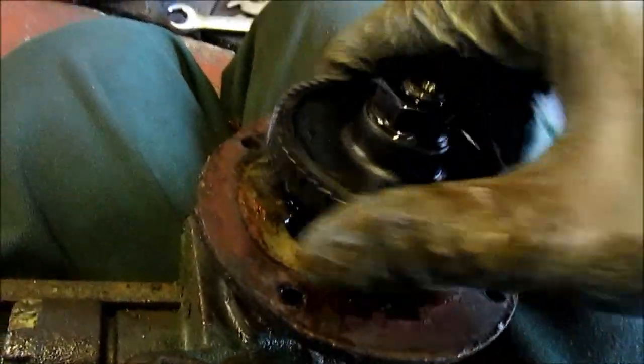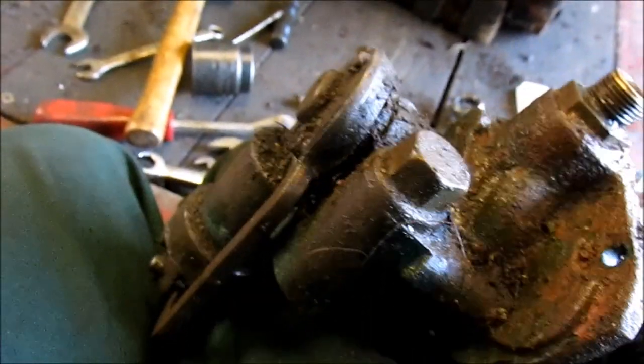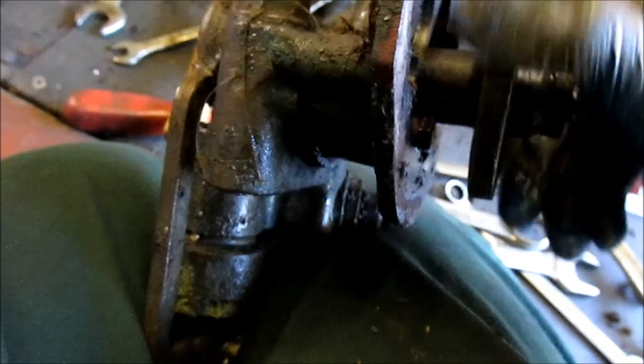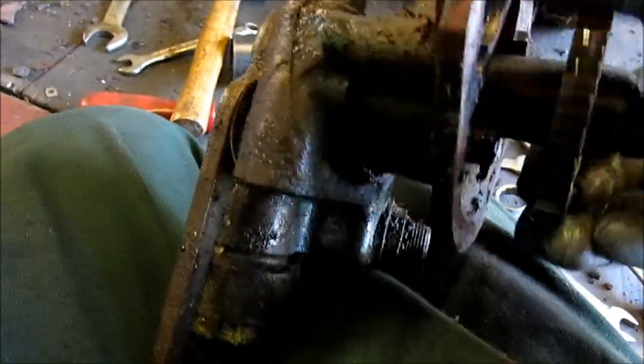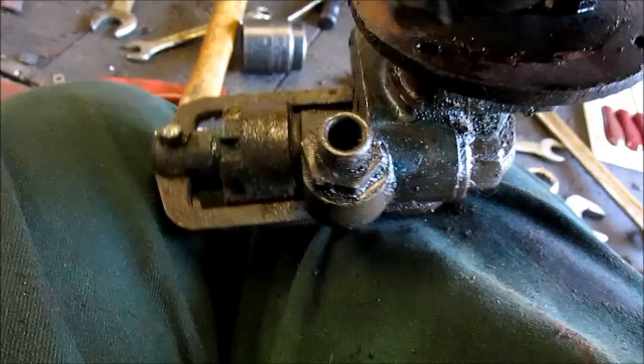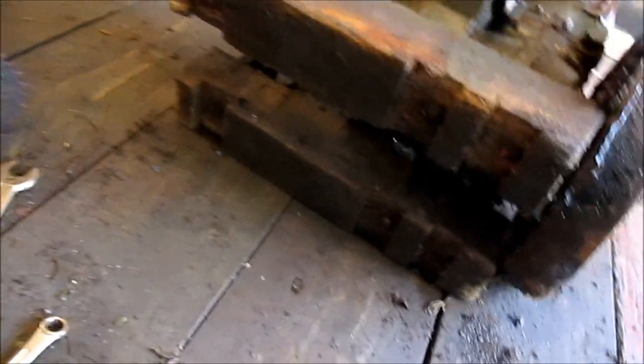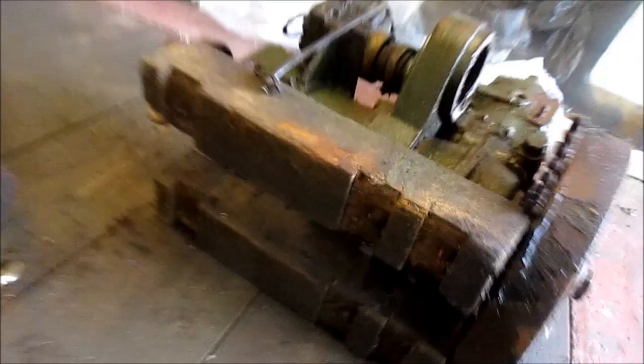The pump's off and it's a bit tight but it's moving a bit more — it's probably years since that last moved. The person who gave it to me said it hadn't run; it was taken out of service and put in a shed for 25 years. The reason for the severe frost damage is that it wasn't properly drained out, but also because this engine worked off the shore of Land's End hauling lobster pots, powering a little small boat. It had salt water in it and that obviously led to a bit of corrosion.